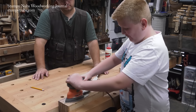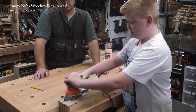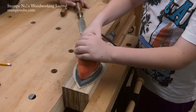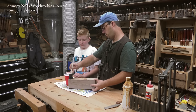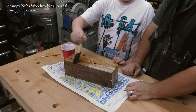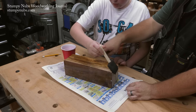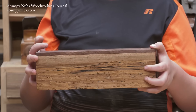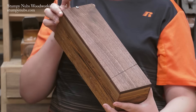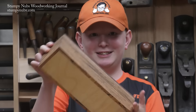I hate sanding but some kids seem to love it — maybe it's because it's a safe power tool to use. Unless you think the dust will choke off their little lungs, in which case you might want to have them wear a dust mask. Remember, his mother will likely be angry if you return him to her broken. Boiled linseed oil is a perfect kid-safe finish. It won't hurt their skin, they can't get high off the fumes, and the box can be handled even before it's completely dry. One or two coats will bring out the color in the wood, and that's always a nice reward for the hard work that went into the project. Most schools these days have eliminated creative classes like woodshop. It's up to us to help the next generation discover the value of being creative and making something with their hands so their lives will be richer and the craft we love will be passed on.